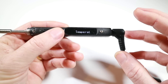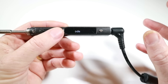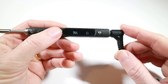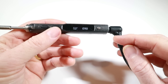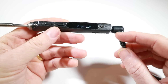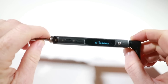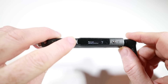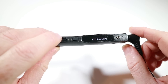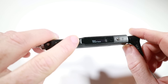My basic temp was around 300 to 350, but if I'm doing a really big piece of cable I want more power, and rather than change the temperature setting I can just hold a button in and it will boost up to that temperature. It's also got sleep mode — a sleep temp triggered after 90 seconds and a sleep timeout of one minute. It's got an accelerometer in it as well, so if I just leave it there and don't touch it, it will go down to its sleep temp of 90 degrees, and you can alter how sensitive that is. Then there's just user interface stuff — temperature units, scroll speed, and bits and pieces like that.